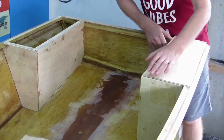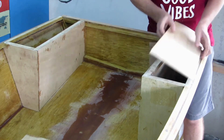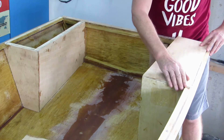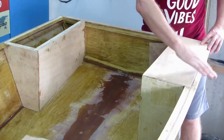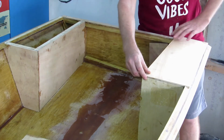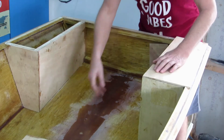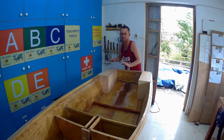I've done the boxes — they're all glued together with no screws, all epoxy. I've already made the tops as well. I need to get two coats on the inside of all of these before we close them off. I'll put a round access hole in these just for access — very little storage is going in these. I have one coat on everything here and two coats on this piece, so before we put this in we'll do two coats on everything and sandwich it down. This is going level with this, and then it slopes off so the line continues along there.